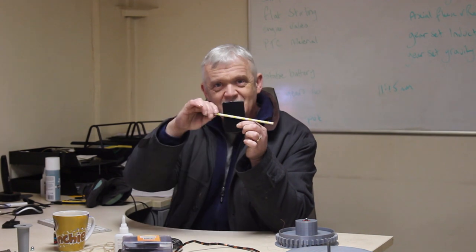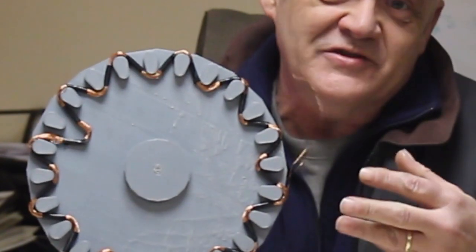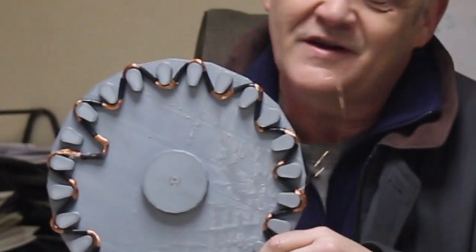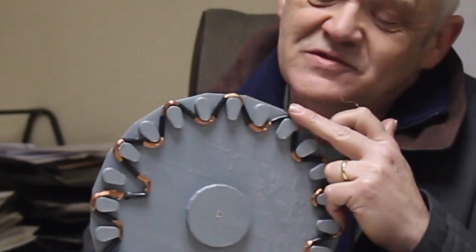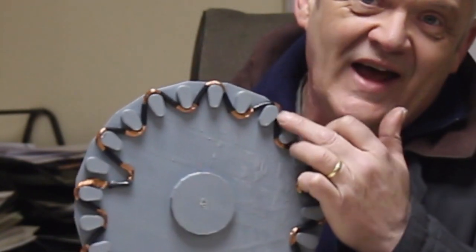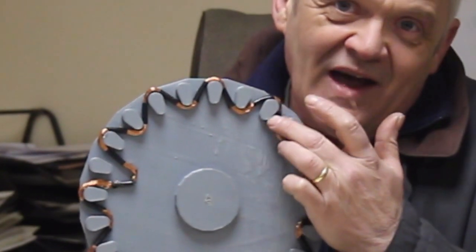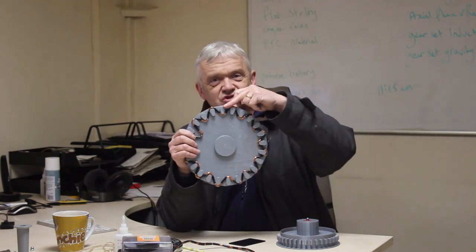So that's going to be the best, that's going to be the worst, and that's going to give you less than that but more than that. The angle really, really matters. So here's a serpentine core we made in a previous video. Let's analyze it in terms of those angles and how it's going to affect generation. Because it's a circle, of course, it's narrower here than it is here. This section here is going at the wrong angle — it's at 90 degrees to the field. So that section is going to generate nothing, as is that section. Because you've wound it this way, we've had to put this at an angle in order to get from one point to the other. That being angled means it's going to generate less than if it was straight. So if we want to improve this, we need to make this as short as possible and put this as straight as possible to get the most out of this kind of serpentine coil.